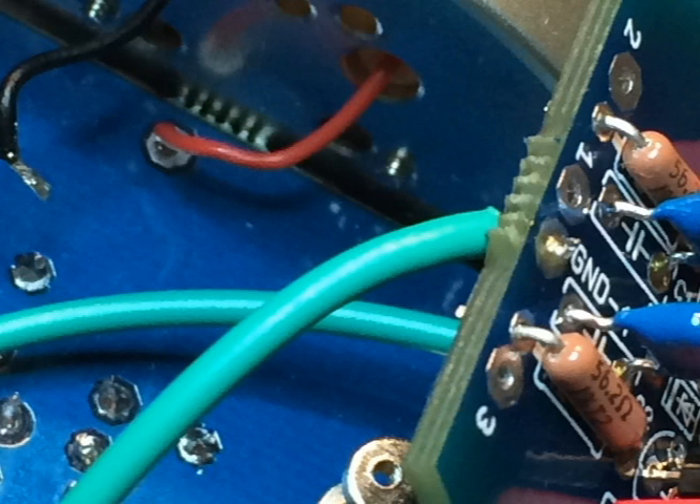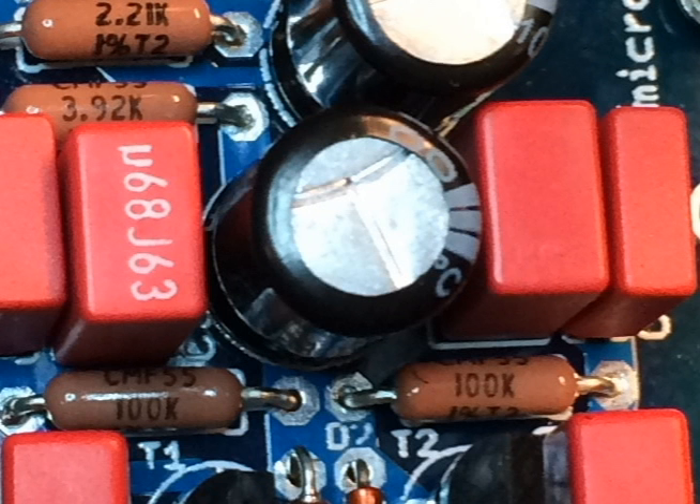It was a lot of fun building the kit, though there was a little bit of challenge. It seems MXL had changed a couple of things in their design from when Matt over at MicrophoneParts.com had designed the instruction booklet. Basically, the pinout from the XLR was different, and that created quite a headache — you follow the instructions, solder it to the board, and then it's not working. I tapped a little diode and could hear a faint sound, but nothing was coming through. I couldn't get voice or anything like that.